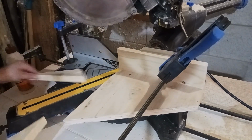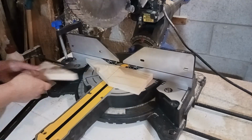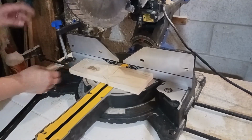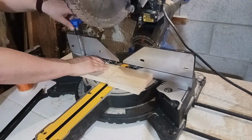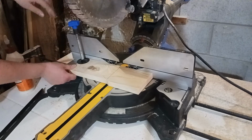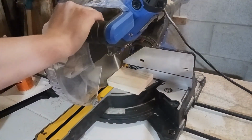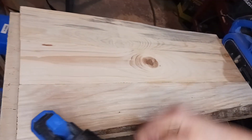Now you're left with 2 sharp angles, but you need to trim off the extra from one piece of wood. I put the piece that needs to be cut in line with the backing and connected the piece we just removed so it can be clamped down. The triangle shape would be difficult to clamp otherwise. Then once it's secure, make your cut. And that's how I would cut this angle. Of course, there are many different ways, so it's important to do what you feel most comfortable with.